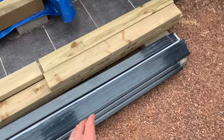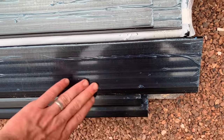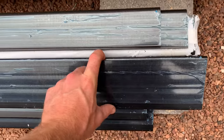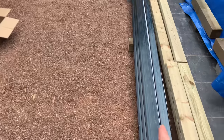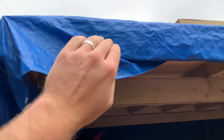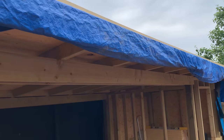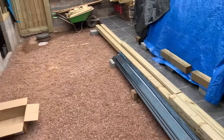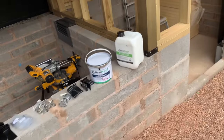And as you can see here, what I was talking about, the faceplate. Along the front edge, the only edge that you're going to see from my garden, we've got the bigger ones, probably 3.5 inch in depth. And then these are the smaller ones on the side, which are probably 2 inch. Obviously the side plates go up there, you're never going to see them, but it just tidies it up and helps pin down the rubber roof. Faceplate, there's the rubber. Got to get that up there on the roof and roll it out, leave it for half an hour, but we'll show you how to set it all up when my mate comes round, because he knows what he's doing. I don't know what I'm doing, but I'm going to give him a good hand, and we'll get a lot better finished job on it. Happy, happy days.